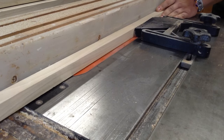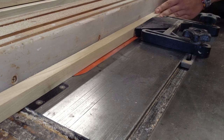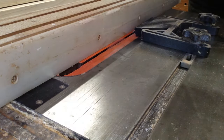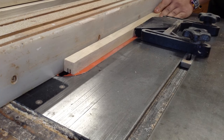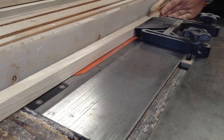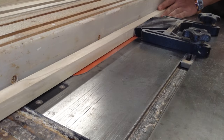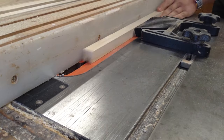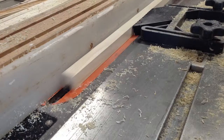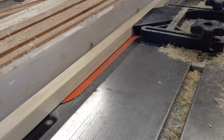This process is the same if you are doing something with doors or drawers. In that case, depending on the span and the weight the shelves might hold, I just make the face frames a little bit thicker — but it's the same process. If you're thinking of doing a built-in, I know these are intimidating just because of the size, but I find making cabinets fairly easy at this point. This style without doors or drawers is really simple — I recommend starting with this sort of build.